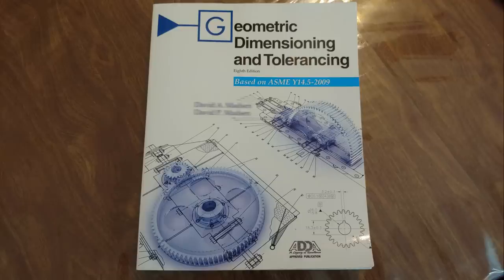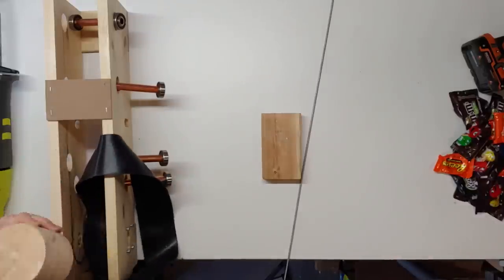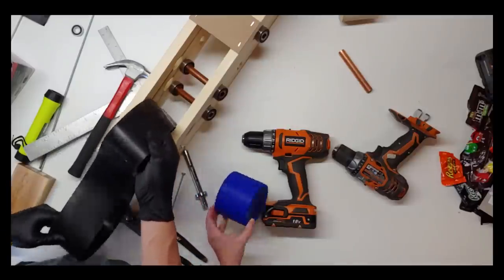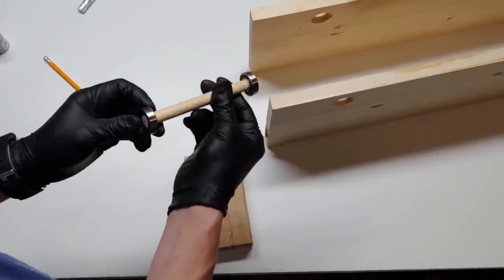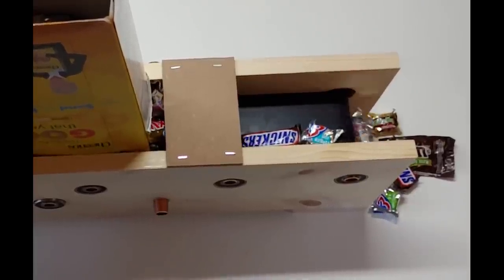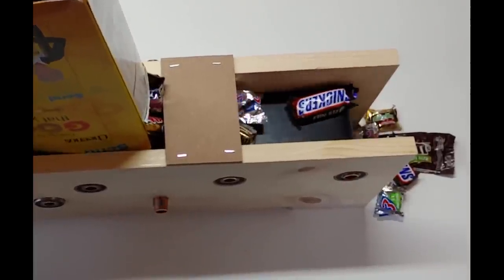There are actually entire systems and books written about tolerancing and all the details, but we won't be getting into any of that. But that explains why we tried to switch from our wooden wheel to a plastic one in hopes of being able to hold a tighter tolerance. The same thing applied to earlier when we switched from using wooden rollers to metal ones. Unfortunately, even with the changes we made, we still saw slight wandering with our system.